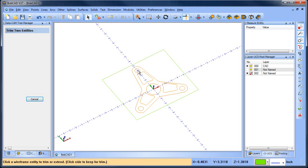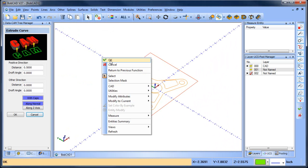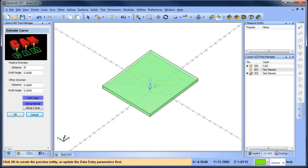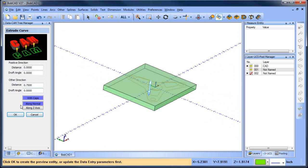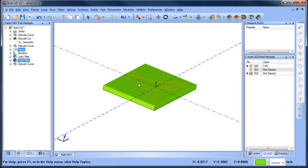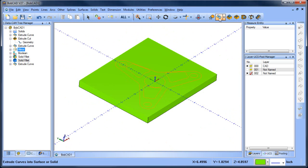From here I'm going to use these hole locations and drill and tap some holes or use some pins - there's a bunch of different ways you can do this. I'm going to extrude this curve; let's go the other way. We'll say it's a half inch, one inch, three-quarter - whatever. Then from there I'm going to cut these holes out, so I'll do an extrude cut.